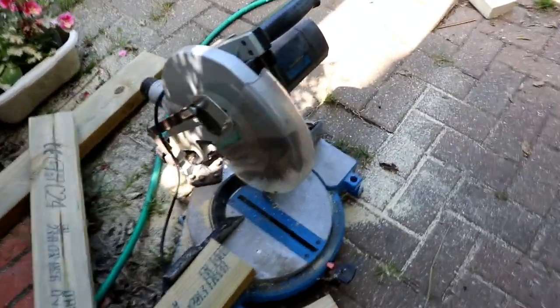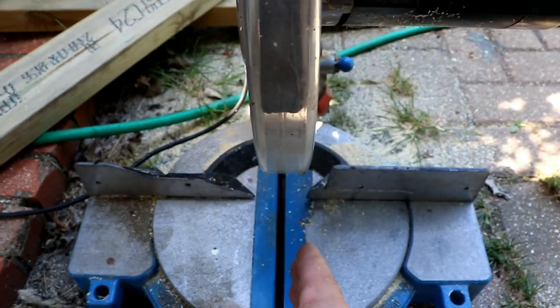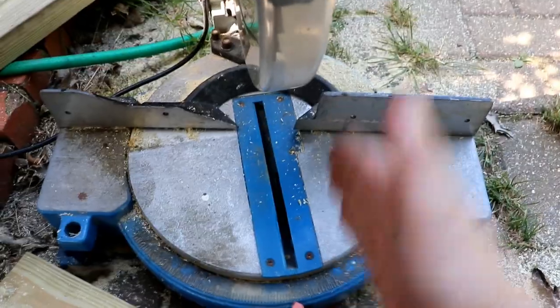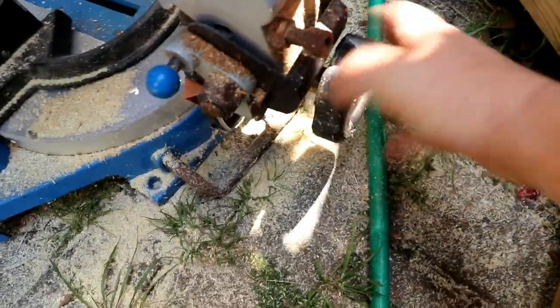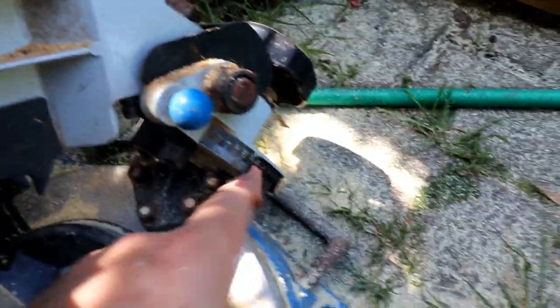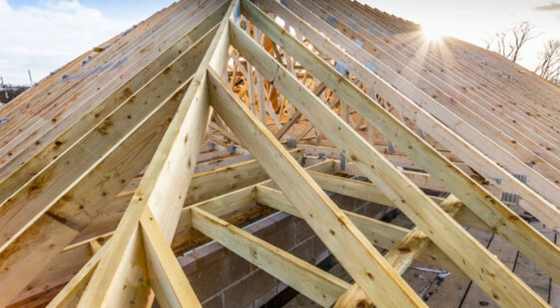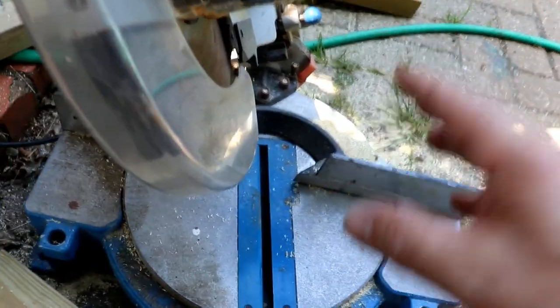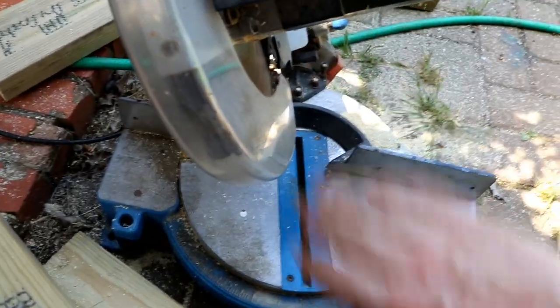This type of saw is so useful because it's portable. You can set the angle — obviously that's set at 90 degrees, so it's a perpendicular cut. Equally you can push this down and the whole thing will twist round so you can set the degrees there. And there's a bit round the back that you can loosen to set it to a particular angle. A little dial thing — absolutely fabulous. Because when you're building things like roofs where you've got the joists coming up, butting against other things — very, very clever structures — once you've got one of these things you can just set up the different angles you require. And it makes you look very clever.